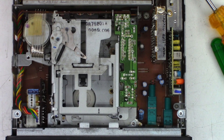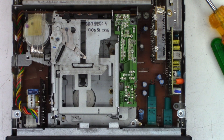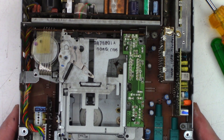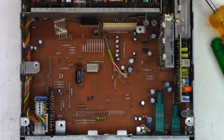I still can't turn the volume down, but it did alleviate the tape issues. The tape transport does work correctly at this point, but I still have a problem with the volume control. So I'm going to go ahead and spray some Deoxit — and I did get a squeal last time I turned it on. I'm thinking there are some bad caps probably back here on the power amplifier board. I get a little chirp upon startup and that should not happen. So I'll pull the mechanism back out — it's only got that one connector — and address the other capacitor issues. I'll have to pull the power amplifier board out of the unit and see if there's anything going on there.